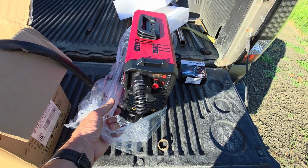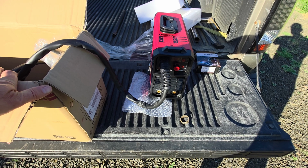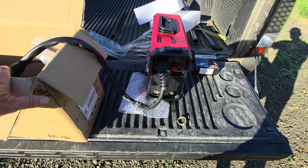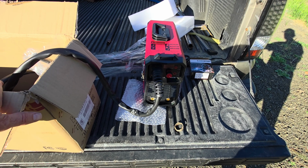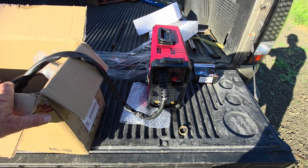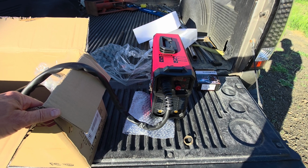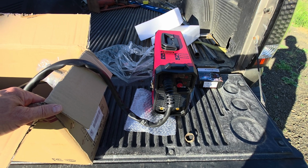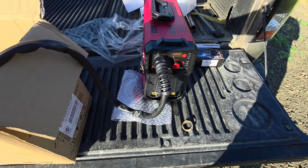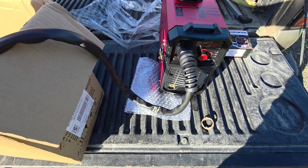I actually like Miller. I have a Miller 110. I have larger Miller machines too, and then I have a cheap Century, which is a 130 amp. The Miller 110 is a 140 amp, and the 130 isn't quite as hot as the 140, but those machines are really just limited to sheet metal. In my honest opinion, 1/8 inch is about the limit. I wouldn't be comfortable doing much more than tacking with 3/16. Being out in the field welding pipe, it was really challenging getting the penetration that I needed. I knew that this was not cutting it.